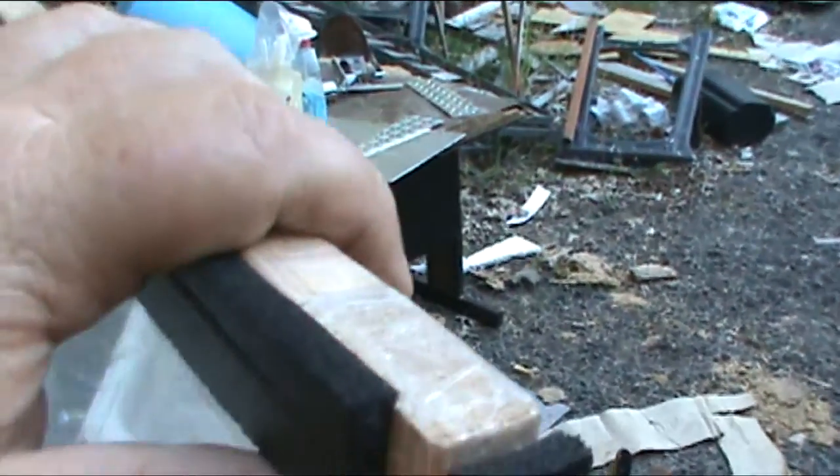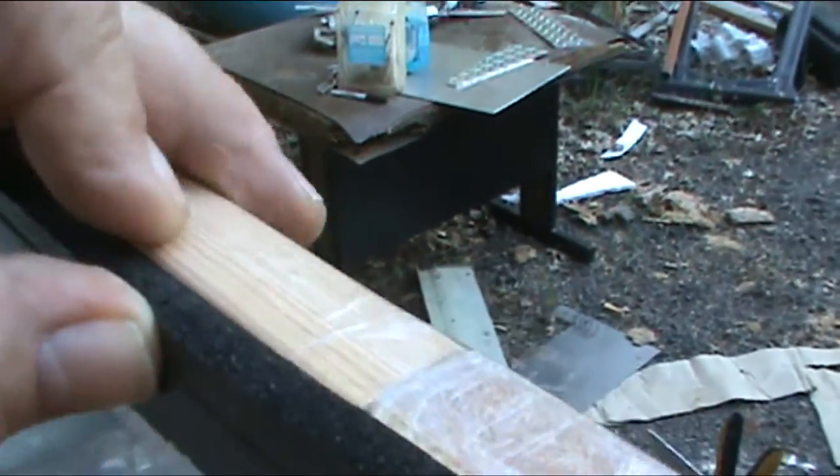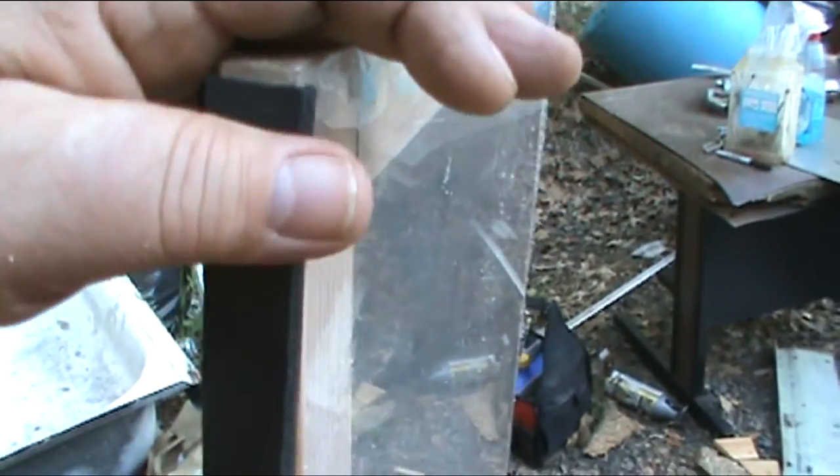Here's what these look like — there are two layers of this stuff. This is that shrink wrap plastic you can get for weatherizing your windows. You just make these frames and put the shrink wrap around — it's taped on with clear packing tape, which is very strong stuff. Then you take a hairdryer and it shrinks and tightens up. There's one on each side, so you do the first one, then wrap the other one, put more packing tape all the way around it, and do it again, and then put these weather strips. So it's time to take these out — it just turned hot here last week — and I'll show you what goes in instead.